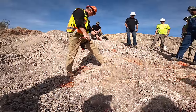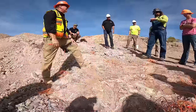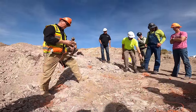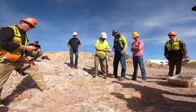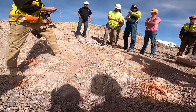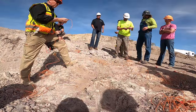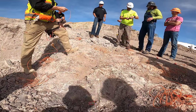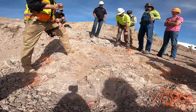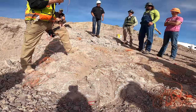So what we'll do, this is going to be row one. These 3 shots are going to be row one. So the delays, what are the delays on these? Okay, yeah, good question. Let's have a look. They're 25 over 350. 25 milliseconds. Yeah, so if you divide 25 into 350 is 14. 14 caps are burning ahead of themselves before the first one goes off. That means in this pattern, they're all burning before the first one goes off because we've got 8 holes, right?